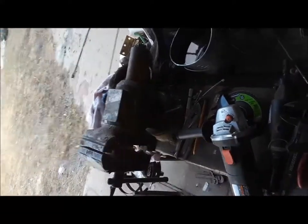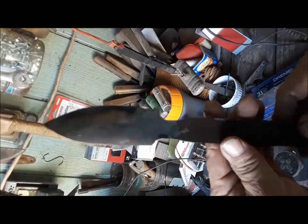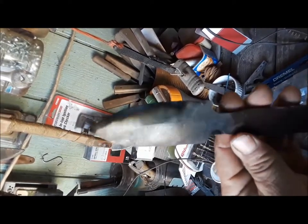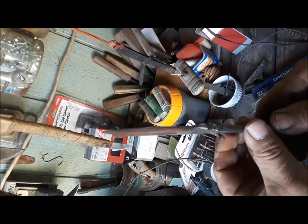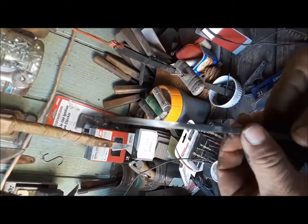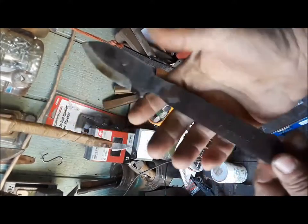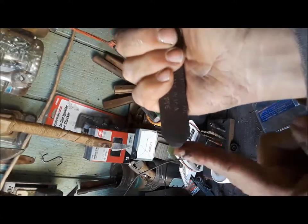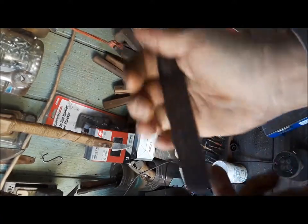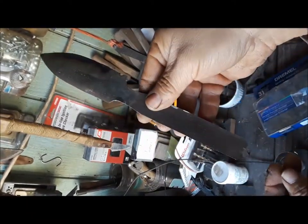After turning the camera for a better view — finished finessing up some of that profiling. I did the bevels by hand; they're not perfect, which is okay. You don't want a sharp edge when you're doing your bevels — you want to leave some beef there so when you heat treat, it doesn't warp. I got the handle straightened out; it's a little bit long, but that's okay because I want to make this end a glass-breaking end. Let's head over to part two.